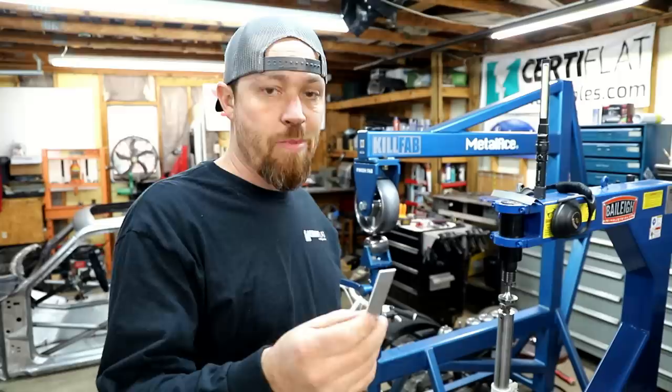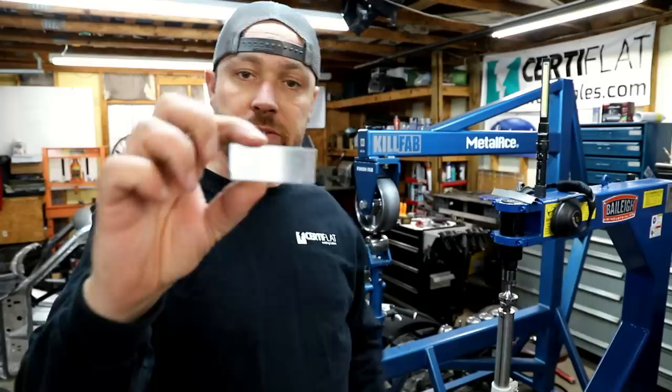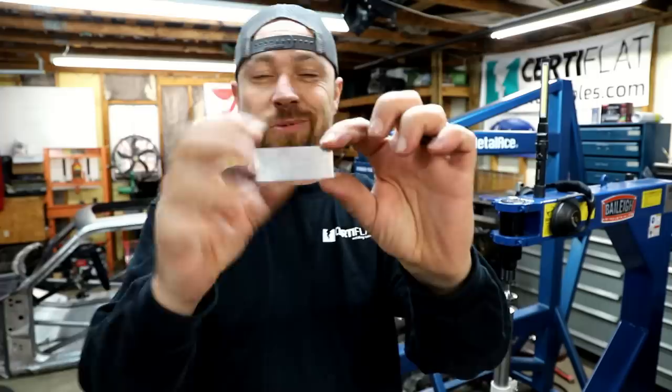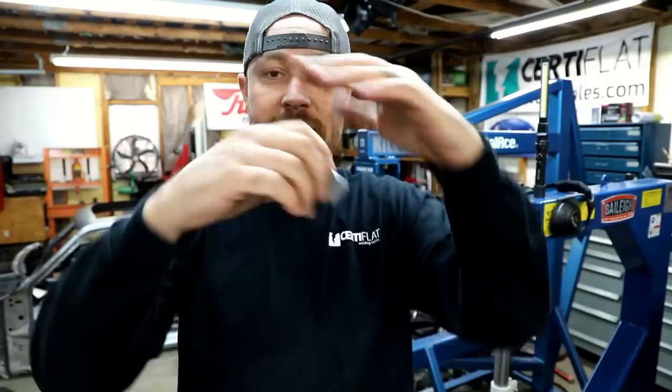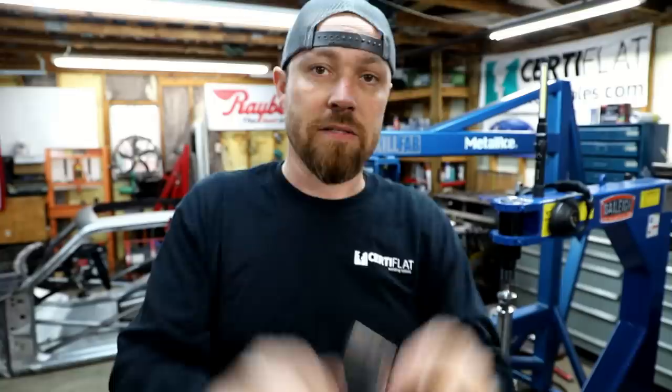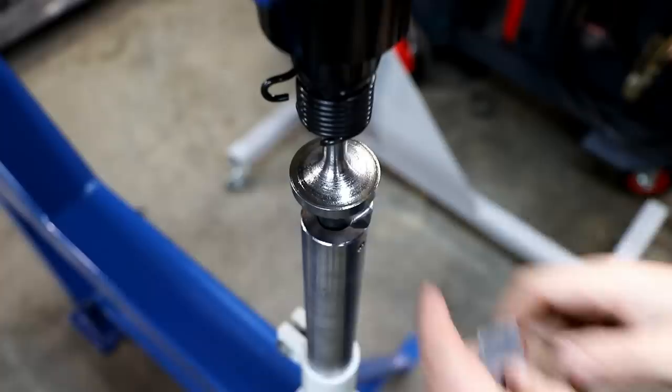Let me give you a quick example of how this plays out. I've got maybe a one-inch, seven-eighths piece of aluminum. If this lower die was perfectly straight and the upper die was perfectly straight, it's gonna smash that flat and stretch the metal perfectly linear. But because that bottom die has a very slight angle to it, it should stretch one side more than the other, and theoretically you should make this thing into a horseshoe. Let's see if the homemade tools work like they're supposed to.